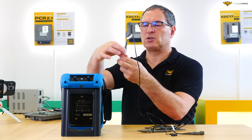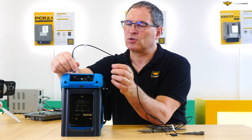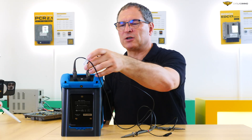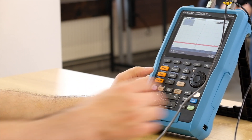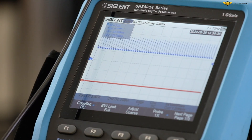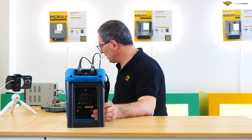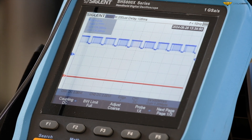It's very important to hold the probe by the BNC plug in order not to damage the rotating part. We'll insert both probes into the BNC sockets — each socket has a corresponding color. Now let's press the Scope button. After turning the power on, we can see a signal that is not a CAN signal. And now it is. Why is that? It's because when the ECU is connected on the table, it needs to have a 120 ohm resistor between CAN low and CAN high in order to trigger a signal.